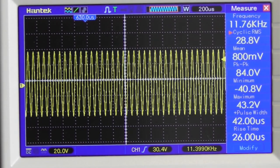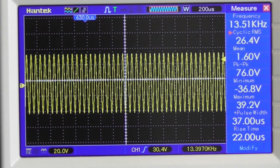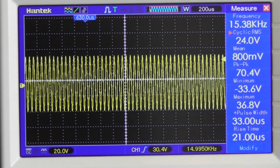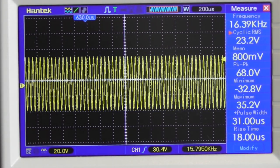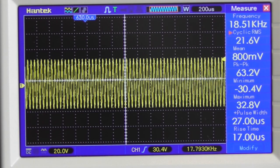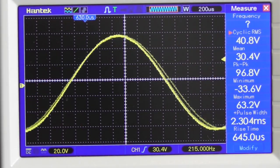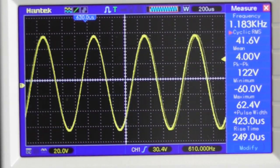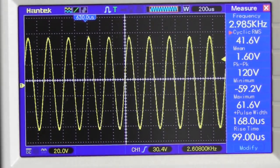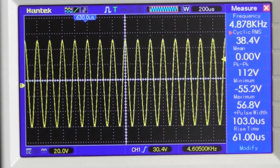and we're now at 11 kilohertz. Its low frequency response is flat as a pancake from 4 or 5 hertz, but when you get to about 5 or 6k, it starts to roll off, and it's now quite dramatically rolled off. And we were at 17, 18 kilohertz, and it sort of stabilizes there and goes back. You can see now how much higher the level is, and there's no EQ on there, and this preamp shouldn't have any EQ, and there's no evidence that it has any EQ.